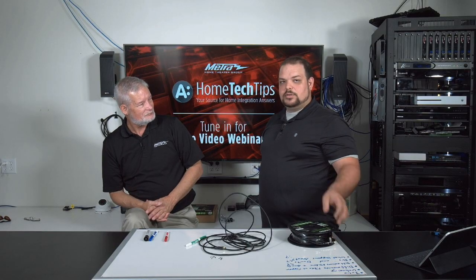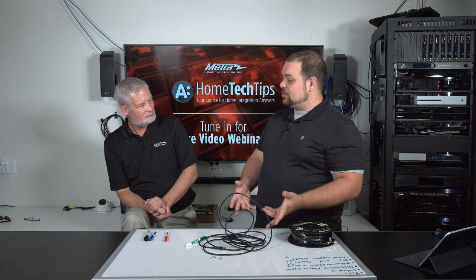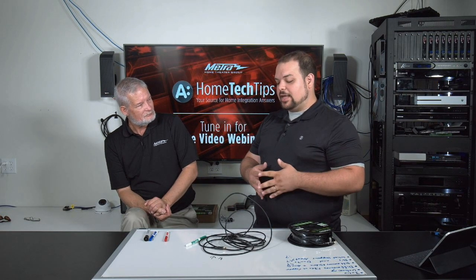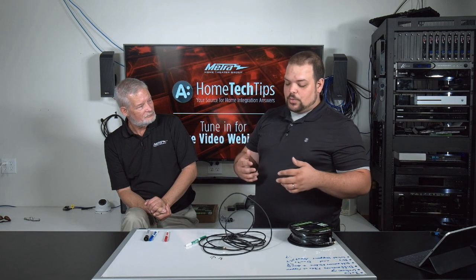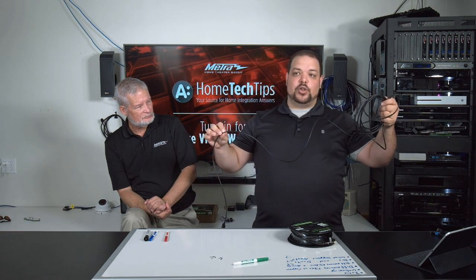I actually had a call yesterday from a gentleman who had one of these cables, running the same thing we're talking about, and he will probably have to replace the cable. So one technique I like to use when pulling fragile cable is to run it down the wall from the top. You go up in the attic, run it down the hole to the bottom where you can easily pull it through without a lot of yanking. Then when you're up in the attic with the reel, I like to place the cable as I'm walking along. That makes sure you're not doing any pulling on the cable itself. Everything's going to be nice and tight.